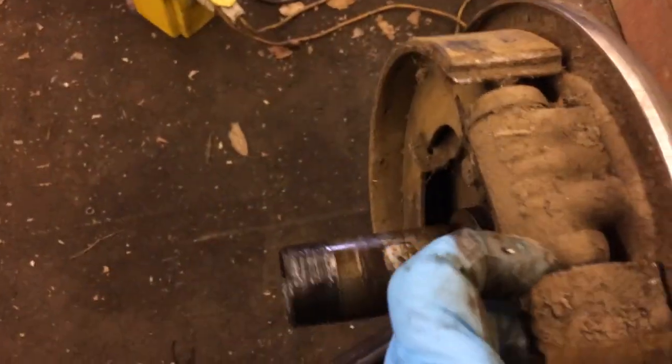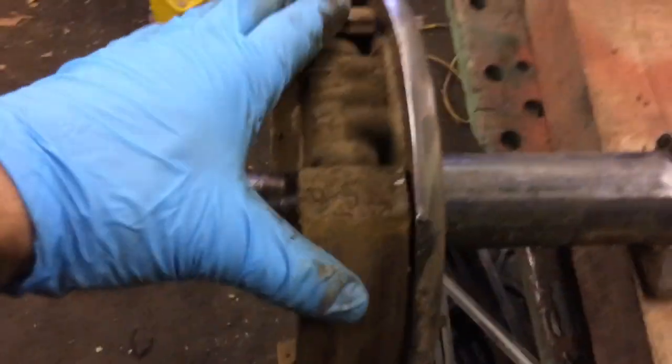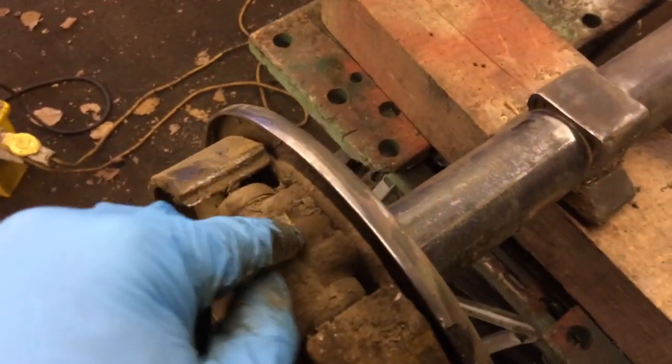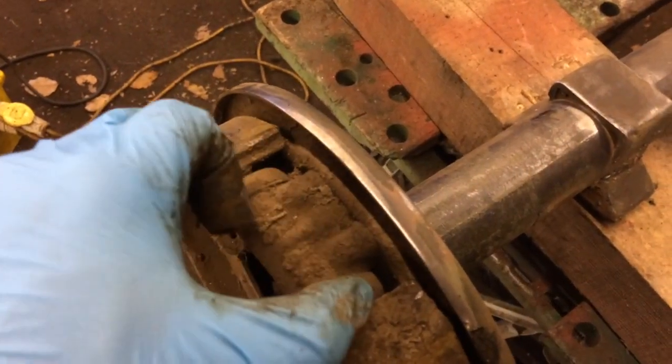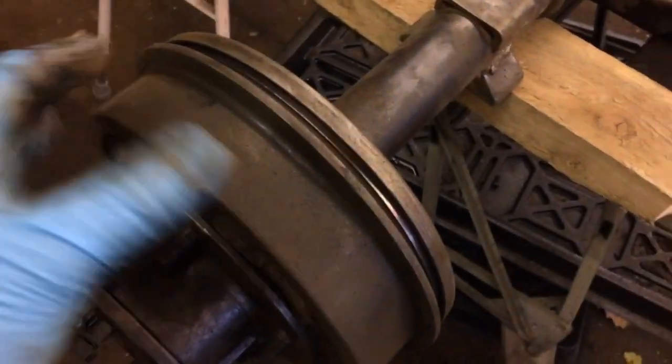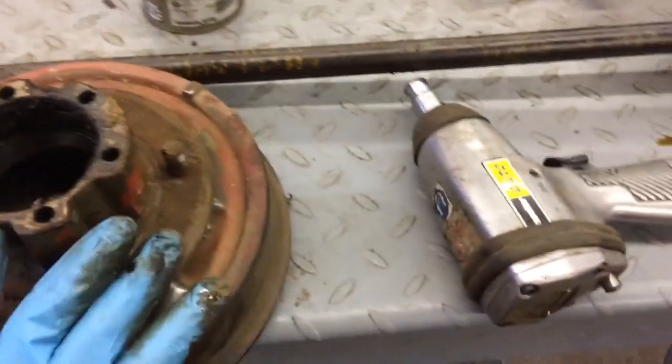this brake cylinder gets liquid through a pipe. It expands, yeah. This moves out like that, being held by this very strong spring that pulls it back together again. But when the liquid comes in and pushes on this piston, it expands these shoes. These shoes have a pad on them, and they create friction on the inside of this bell, which is this, basically. You see? And that's how the car basically stops, brakes. Stops its movement.